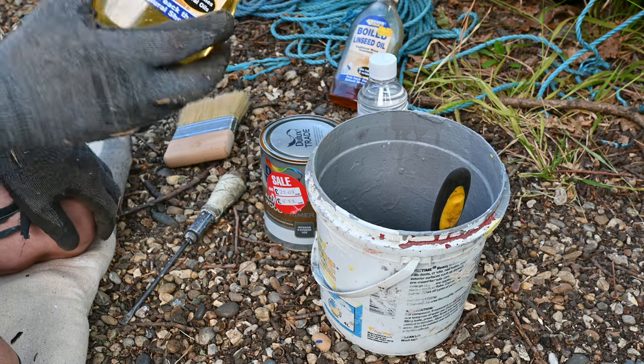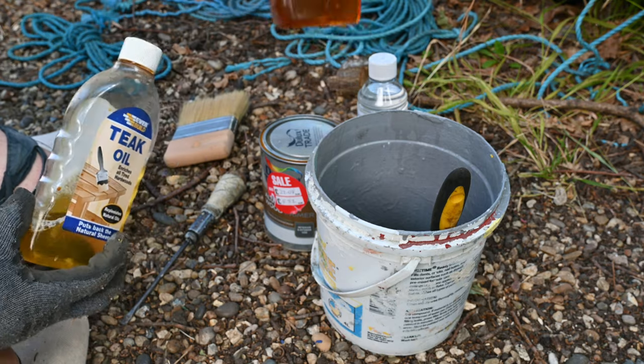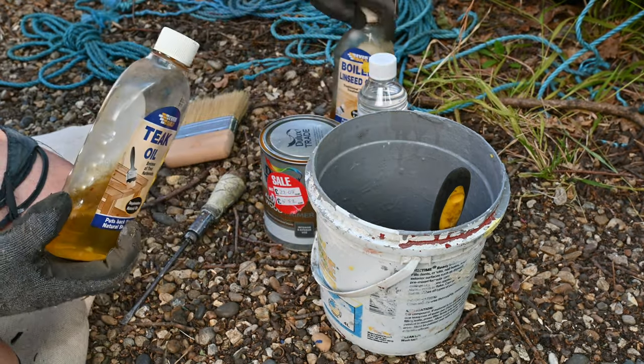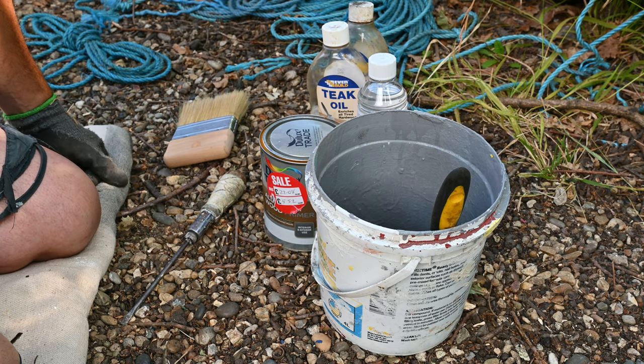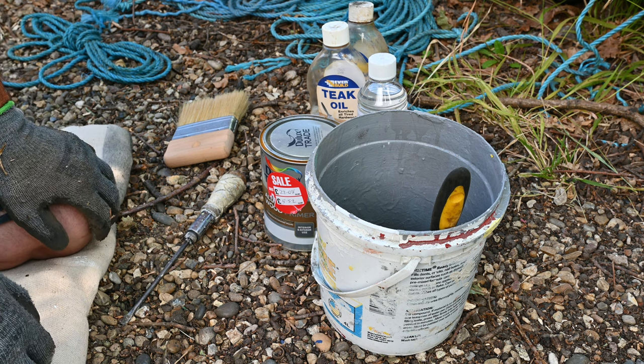I'm going to add some teak oil to it, just because I've got some, as well as some linseed oil, again just because I've got some. This is basically what I rummaged around in the workshop and found. It's just to give it some extra oil for the first coat particularly. So it'll be a really thin first coat with a lot of oil. It'll take ages to dry, but hopefully it'll really absorb into the wood